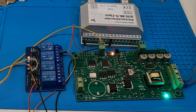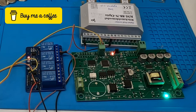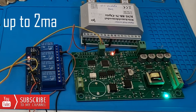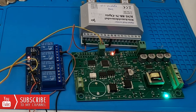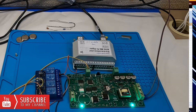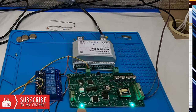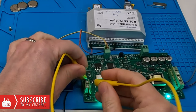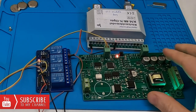I'm going to monitor the external LED supplied here. There are other ways to do it — you'd need to buy other modules which I didn't have at the time, so I wanted to work out how to use what I've got. That's why it's important to use optocoupler relay boards here — they only take 5 milliamps, whereas the output on this can go up to several milliamps above that. We've got DCC input and DCC output, and that isolated power district would be live. I'm going to simulate a short here — just shorting across, a real hard short — so you can see it trips off really quickly.